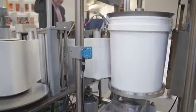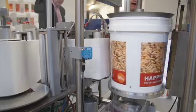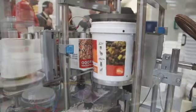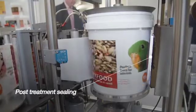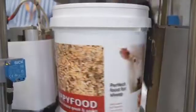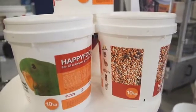A printed index mark on the label and an electronic eye on the Tronix decorator are used to start and stop the application of the label so it aligns correctly on the pail. After the label is transferred and bonded to the pail, the same open flame head that provided the pre-treatment now applies a post-treatment. This post-treatment seals the label bond and brings out the gloss in the label release. The pails, decorated with a Zycon digitally printed heat transfer label, are now ready for shipping or for sending directly to the fill line.